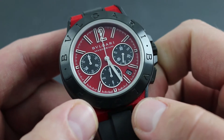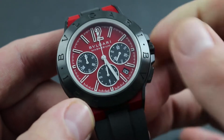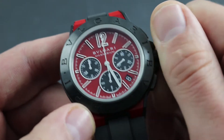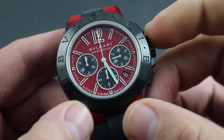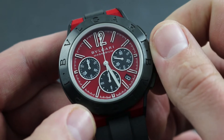However, should you wish to manually wind the watch until the 42-hour power reserve is completely energized, simply continue turning the crown. Because of the bridle-style mainspring of this automatic movement, it cannot be accidentally overwound, so simply wind until you're satisfied that the power reserve is fully topped off.